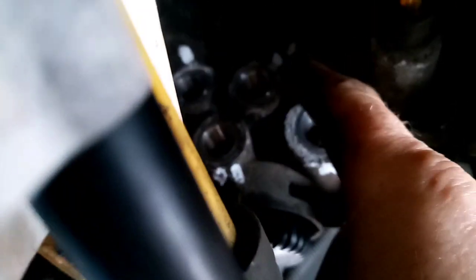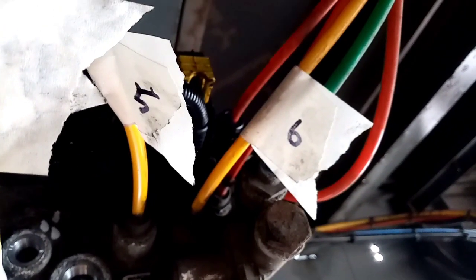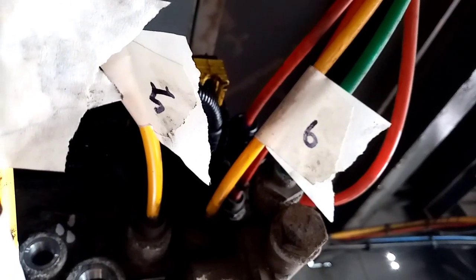I'm labelling the pipes with masking tape and marking them, and then on the corresponding port I'm just putting a blob — like one, two, three — so I know which pipe goes where. In the past if you mark the pipe with Tipp-Ex that tends to get rubbed off and you'll lose which pipe goes where.